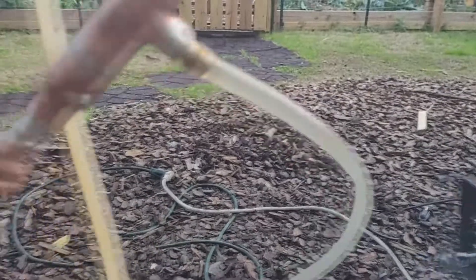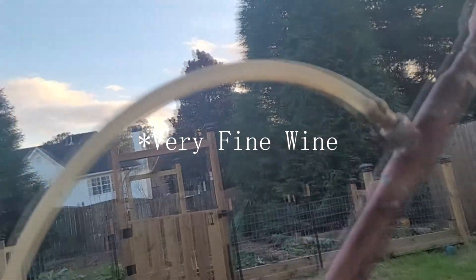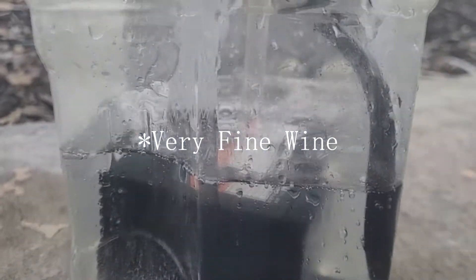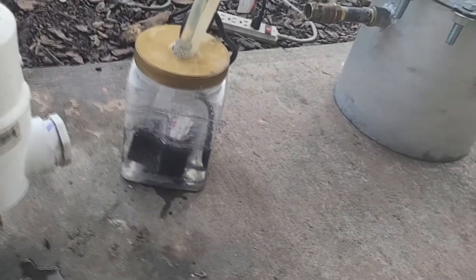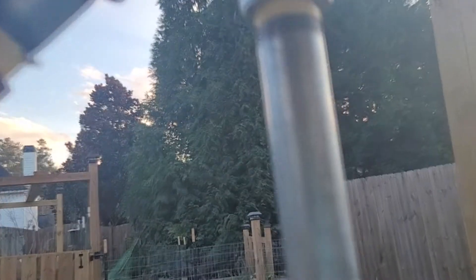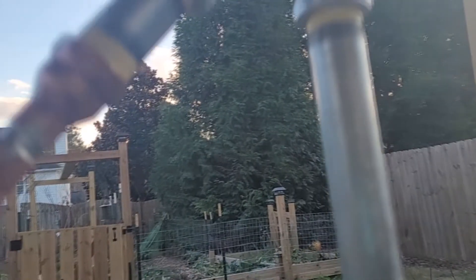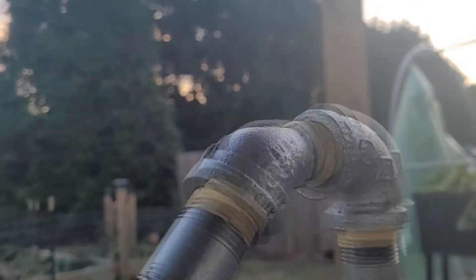Oh, look at that — amazing. It's a nice fluid movement now. This is all part of the plan because if I'd done this from the beginning you'd never be able to tell that water's in there from the camera angle. This water will be ice cold — it's pretty cold now because it's wintertime and this is rainwater, but we're going to put ice in there. The fumes come up here and get up here, and they reflux on the way up because there's a piece of steel wool in here, just like in stills. I've tried this before and usually the steel wool gets clogged with stuff, but that was with the thinner pipe, so maybe this bigger pipe will help. It gets the heavy stuff out so it doesn't clog this area — the heavy stuff falls back down to get re-broken down into smaller particles.